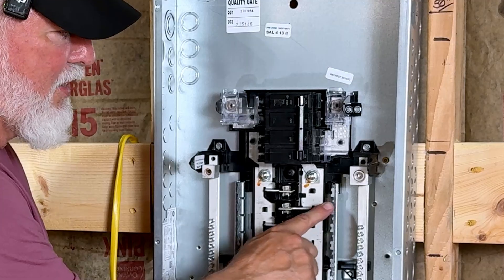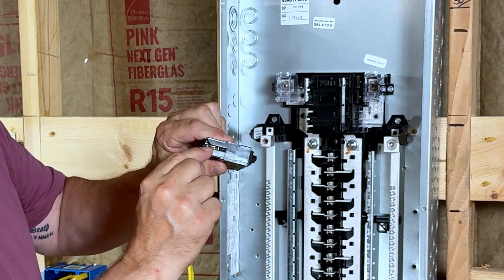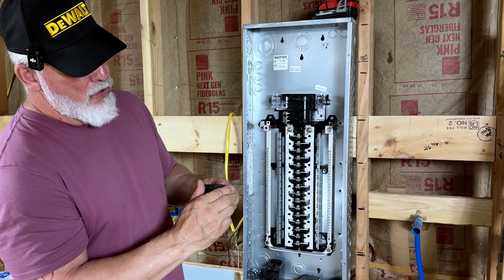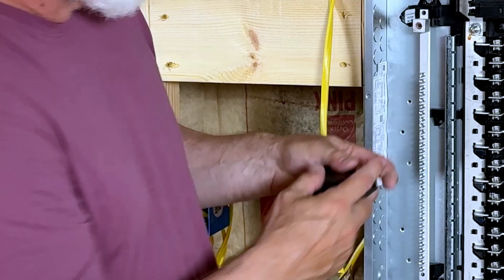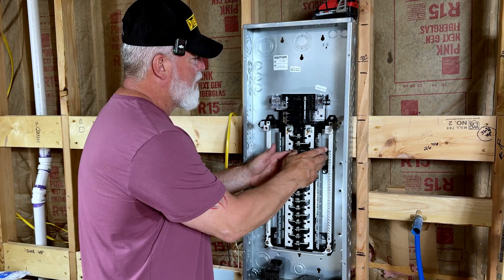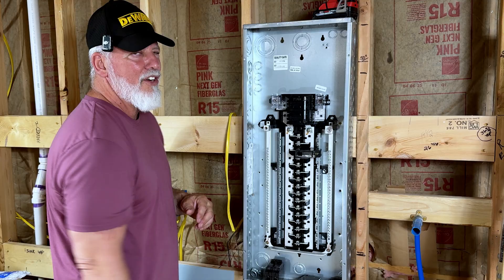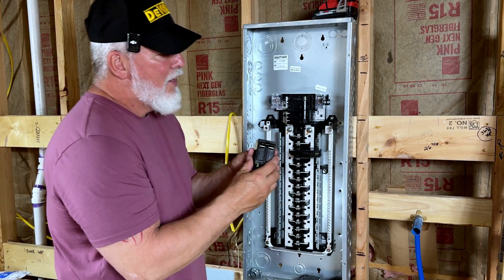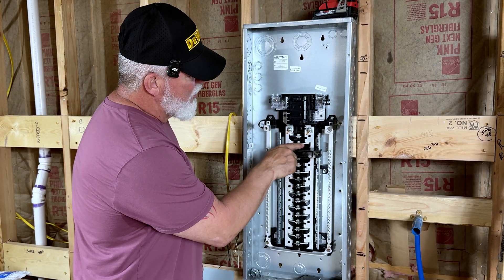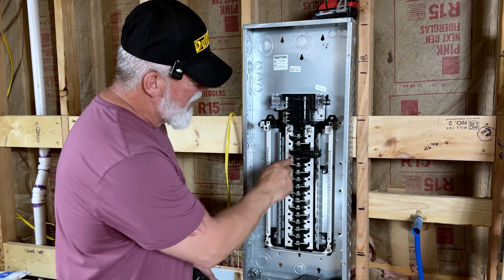The rail holds the back of the breaker. You have a little clip, and on this side a little spade that goes over each one of the bars. The wire goes here and tightens here. You take this little clip, put it on the bar, and place it just like that — now that one is ready to go, I can turn it on or off. That is a single pole breaker. This one right now is getting power just from the B side, the red side, giving me 120 volts at 20 amps.